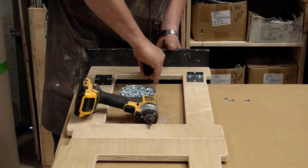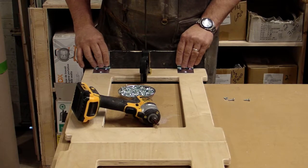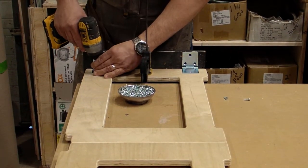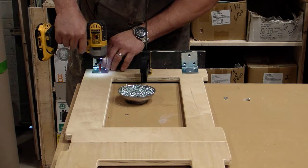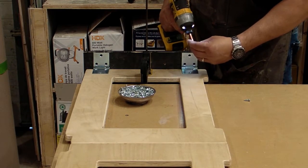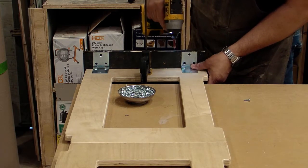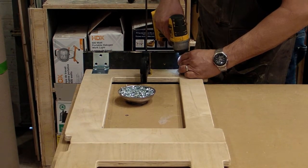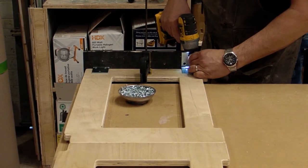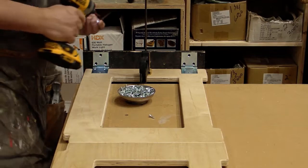It's lined up. I put the clamp in just to hold it in place, then I put the hinge in so that the barrel — the actual hinge point — is up against it and doesn't protrude past the ends of the pieces of wood. Screwing it in, I do the exact same thing. If I find when I'm starting a screw in a hole and it looks like it's slightly off, I just angle it aggressively towards where I want it to go and then straighten it up after a sixteenth of an inch or so, and it usually straightens up right inside the center of the hinge hole.